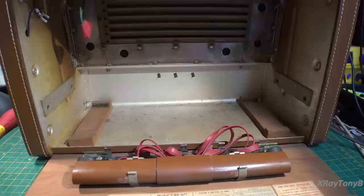This is a beautiful radio — it'll be a showpiece, but also a working showpiece that'll give many more years of listening pleasure. The only thing we have to watch out for is silver mica disease in the two IF cans. Hopefully they'll be okay, but if not we'll have to rebuild them. Anyway, that's way down the road. First things first: why aren't we getting power?